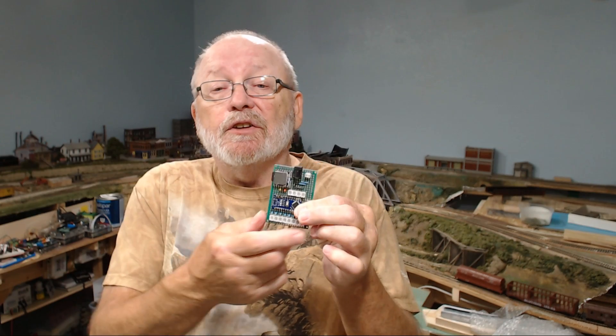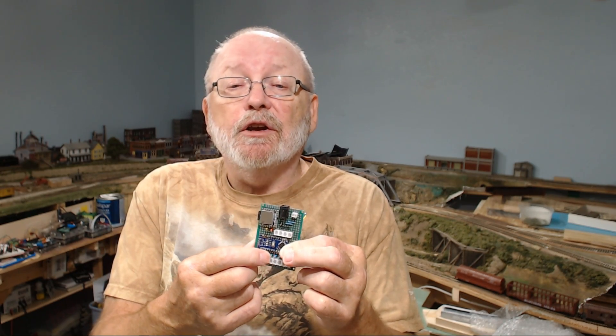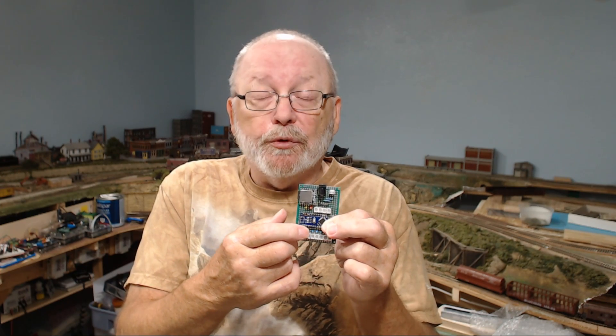That's a very inexpensive way to light up your model railroad — use wall wart magnet wire, or if you prefer not to work as hard, get the Remington wire without scraping insulation. You can mount it on a circuit board like this, use connectors or solder wires directly, and add your resistors. On future builds I'm going to use all SMD resistors instead of through-hole ones. As usual, everything I mention has links in the description, and related videos will appear in the info boxes. Until next time!